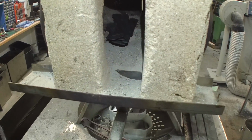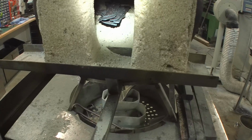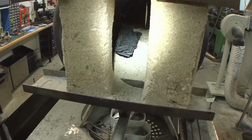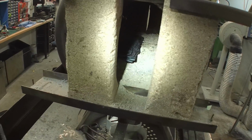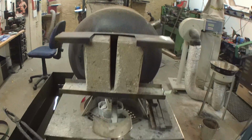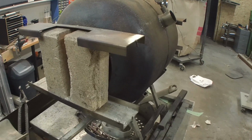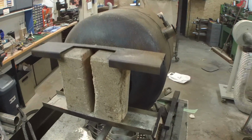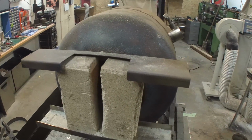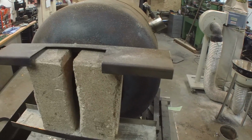Okay, now as you can see in there are all the steel pieces. I forged them out straight, and now I'm gonna let them cool down very slowly with my furnace. And I put them in when the furnace was glowing red or orange at about 800 to 900 degrees, and hopefully the steel will get weakened and softened, annealed with this step. And I'll let it in until tomorrow. And tomorrow we're gonna get the steel out, file test it, and look how the pieces got.